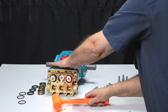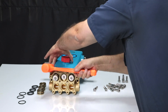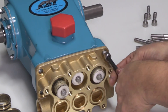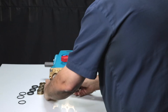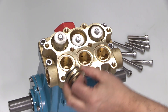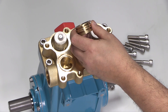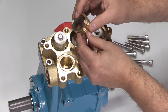Use a rubber mallet to ensure the manifold is flush with the crankcase surface. Hand thread in the four inlet manifold hex socket head bolts, then use an 8mm hex wrench to tighten and torque to proper specifications. Position the pump vertically so it rests on the rear crankcase cover. Remove the O-rings from the high pressure seal spacers with a pick. Inspect the grooves and inside diameter for damage, then use this spacer to seat the high pressure seals.